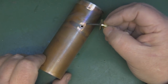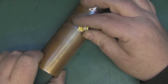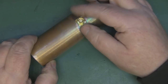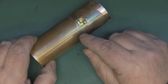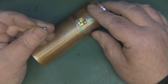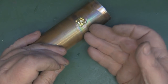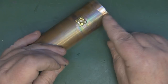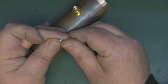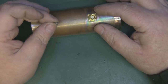I've covered the probe with heat shrink tubing to make sure it doesn't short out on the side of the can. Normally I'd solder the connector in place, but because the copper is quite thick, I'd have to get a lot of heat into it - which would likely spread and desolder the back reflector. So I'm going to drill holes and use small screws to hold the SMA connector in place. I'll drill using a 1 millimeter drill bit and let the screws self-tap into the soft copper.